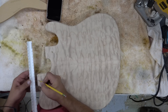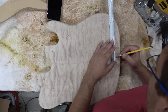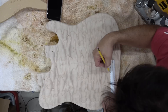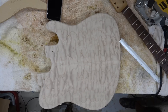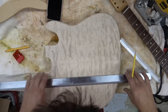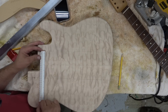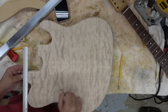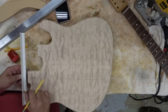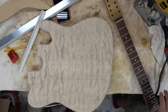So we're going to lay out the necks next. I don't really have a center line to follow, so I've got to create my own. I'm measuring the distance from the center of the join and then carrying that line through with my straight edge — you guys need a long straight edge in the shop. The routes are off by just a slight difference, which made me really aggravated. So measure once, measure twice before you do any cutting.